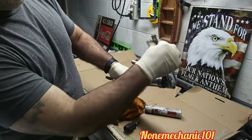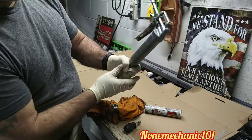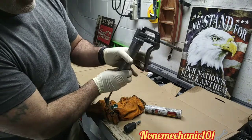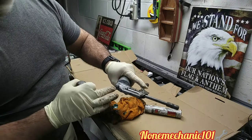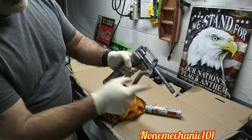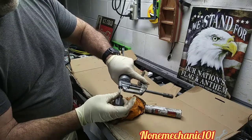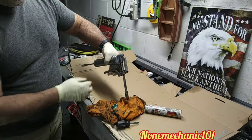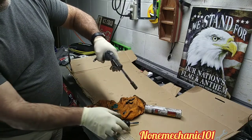Closing it — once you close it, it's nice and tight, but you have to push this down and hold it there. Now, see the bleeder valve there? If you didn't have a bleeder valve, all you'd have to do is keep squeezing it and let this loose a little bit and squeeze it until the grease comes out. But in this situation, all I'm gonna do is just loosen it up here and start pumping it. See how the grease started coming out? Then close it, and that's it.